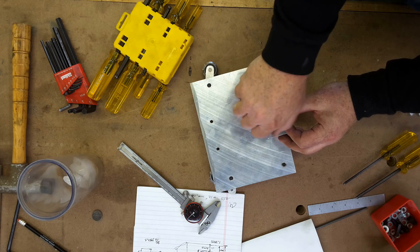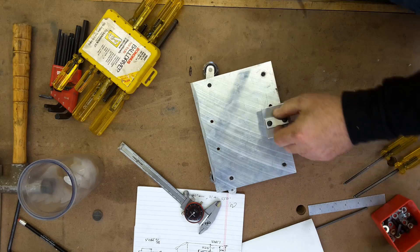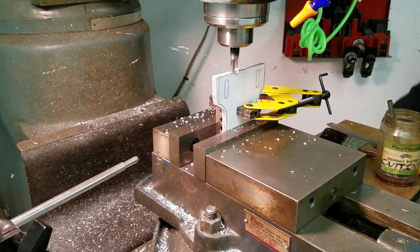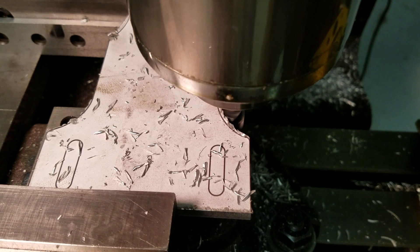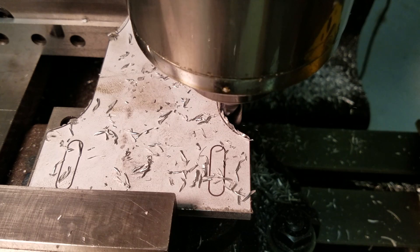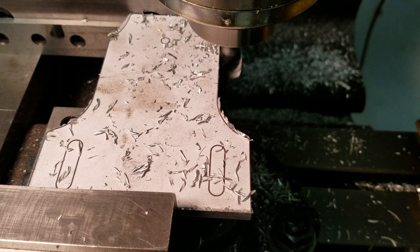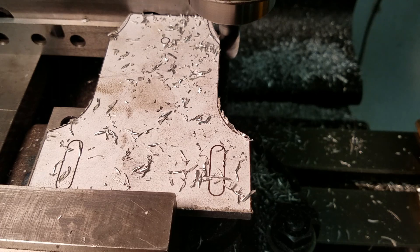To create the clamp on the back of the anchor point I used a piece of half inch square aluminum stock — drilled a couple of holes, tapped a couple of holes, and that's all it takes. The last part of the tensioning assembly is this plate — it's the backstop — it's what the threaded rod goes through for the tensioning end of the assembly. I made this out of a piece of quarter inch aluminum plate. The only critical dimension is the spacing between those two slots; they match up with a set of holes that are already drilled and tapped in the y-axis end plate. So beyond that spacing, this whole thing is pretty ad lib by nature.